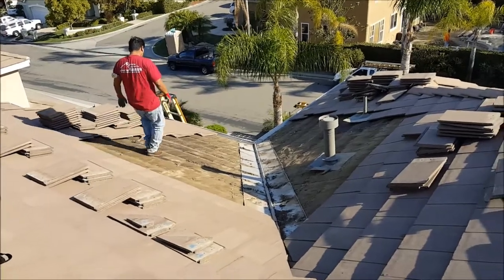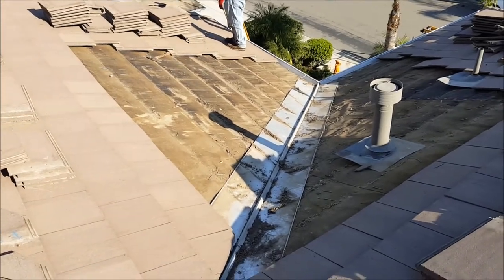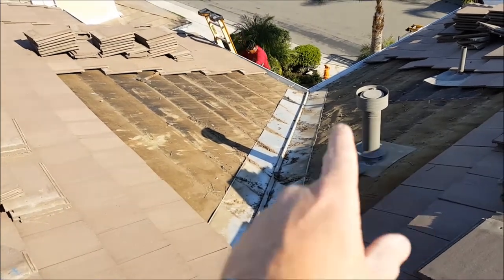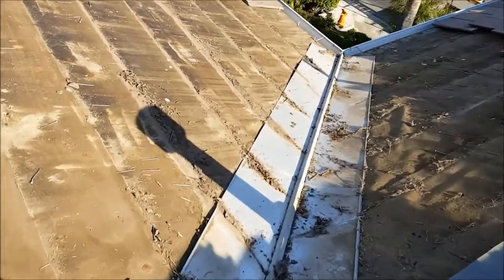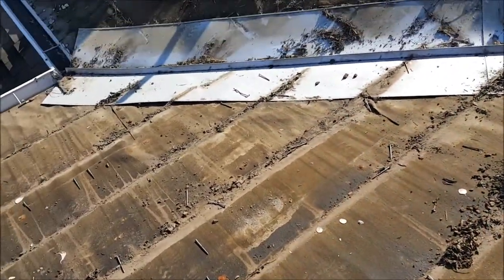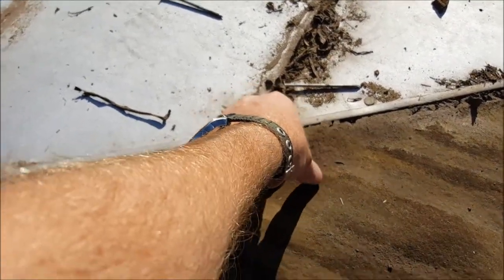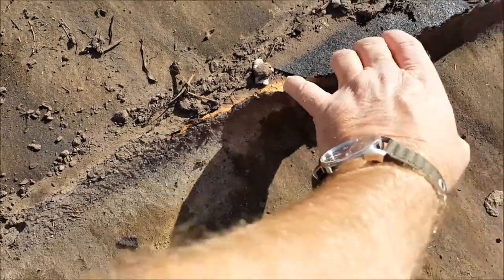We're gonna show you what it looks like underneath your roof. Every now and then other guys do what they call a valley clean-out — they take out the tiles right in the valley, clean out the dirt, and then mastic everything else. That's just a bad idea. It's never gonna solve anything. You can see there's some major paper damage. Right here, this is probably worn completely through — their little clean-out is not going to solve that. Look at that — the paper is just coming up, BAM, right under the roof right there.